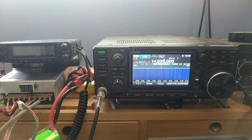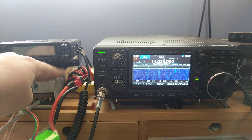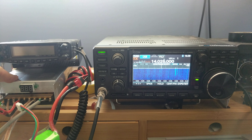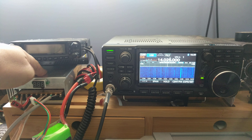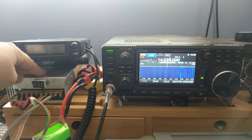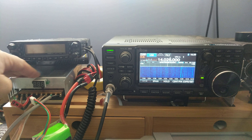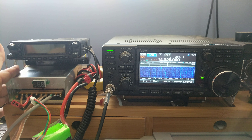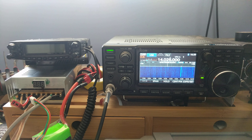So that's the final proof that these power supplies are noisy. I've been using it and I'm going to keep using it for a little while until I find something to replace it. I've made plenty of QSOs, a lot of FT8 contacts with it as-is. There's plenty of room between the spikes of noise to operate, but sometimes it lands right on top of somebody you want to talk to, and it's really annoying. I think this may be relegated to battery charging and things like that, and not run my ham radios in the near future.